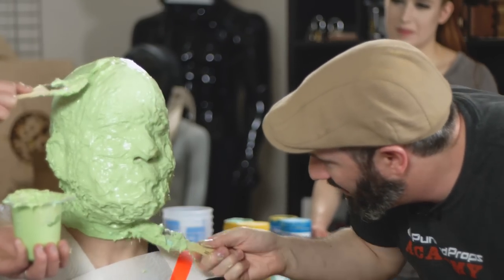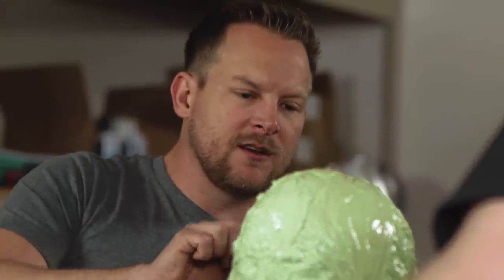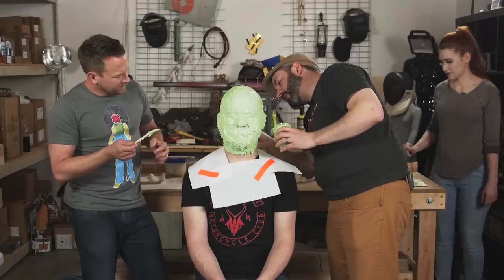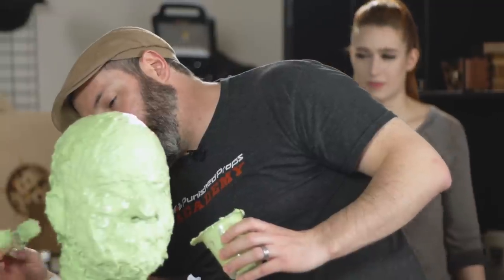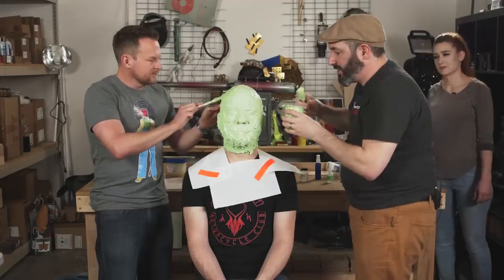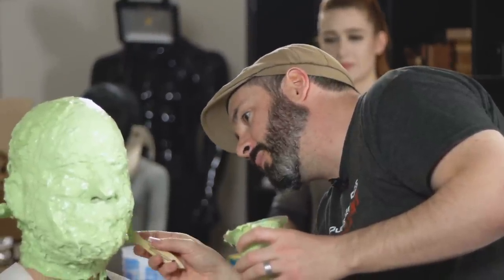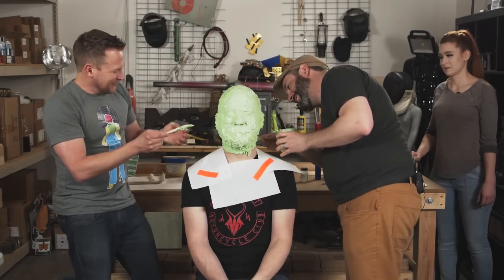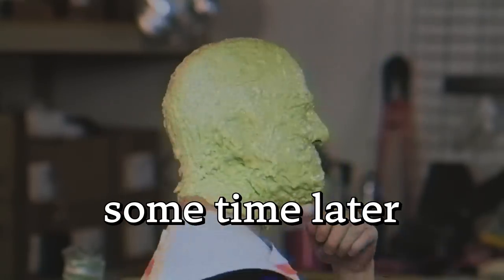The thinking is that detail for any appendage like the ear — you want as much silicone to preserve those details so it doesn't deform when you're casting out of it. I'm going to go over your eye right now. Once we do a whole layer, maybe brush some extra in a line down the back. Overall this is a fairly thin mold — the durability isn't great, but the idea with a life cast is you really only need the one casting from the mold.